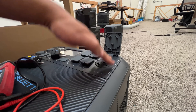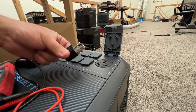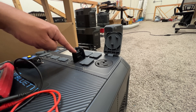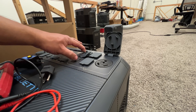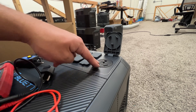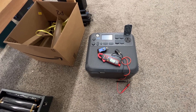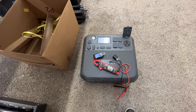This is now plugged correctly — this matches that. It's got a floating ground, so when there is no ground bonding going on, the polarity doesn't really matter. But as soon as you bond it — an application where you might ground-bond this unit is if you use it as a UPS and plug it into your building's wiring, because your building's wiring has the neutral pin connected to the ground pin. When that happens, an issue could arise if this plug were wired incorrectly. But now that they've fixed this, the unit should not have any more polarity issues. You should be able to bond it when used as a UPS and all the plugs will match — the neutral pins and hot pins will be correct.